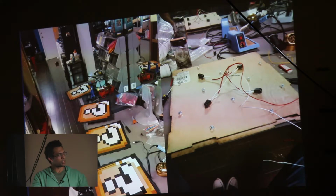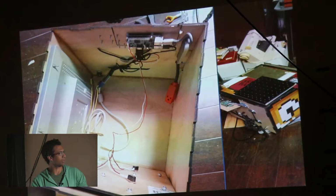When I was working on this project, I picked out a series of kick drum switches for the base of the box, so you could punch it as hard as you want. You can kick it. You can do whatever you want to it. It's made out of plywood and kick drum switches, so it will take that, and hopefully it'll register. I tossed in a bunch of diodes on top of the switches so that they wouldn't go the wrong way to the Pi, but probably was unnecessary if I'd done my wiring right.